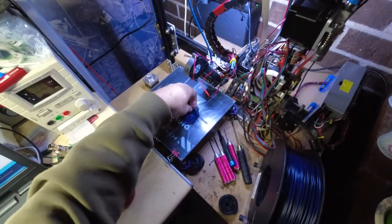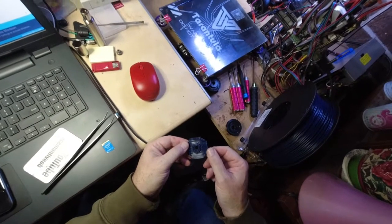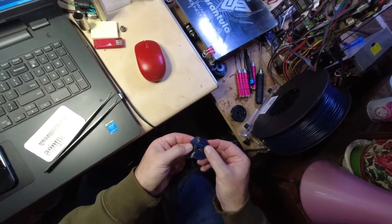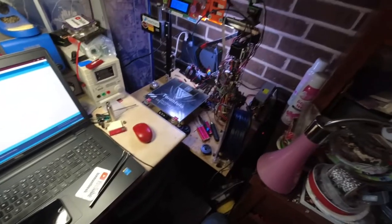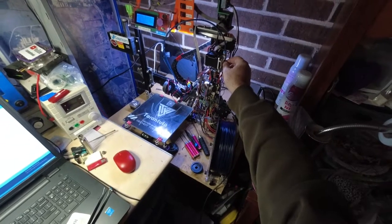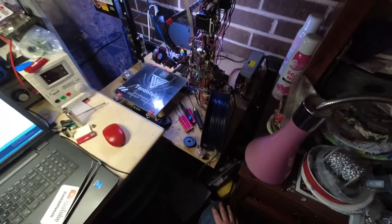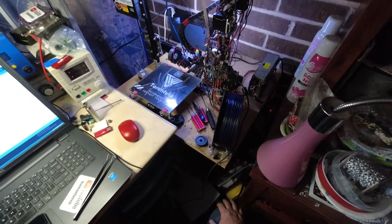Well, this thing is squirting out a lot of plastic. You can tell because it seems to be pushing out really wide, and the part that I was printing is spilling out and over. So now I've got to calibrate the extruder motor and figure out how fast we need to go. I had it set at 395, which is what the old one was, but I guess if this gear is a little bit different in size, it's going to matter. So it seems like we're extruding too much. But other than that, it's working. So thank God. Now it's just software tweaks from here. All right, we'll see you in the next one.